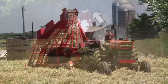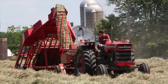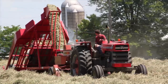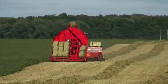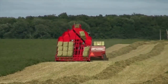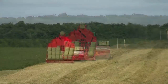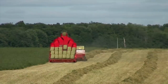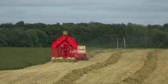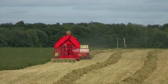On some models, the innovative twist design of the front chute places the bales on edge. Then gravity takes over. Guided by simple mechanical gates, the bales begin filling rows. The last bale in each row moves a gate which opens the next row. When all of the rows are filled, the last bale in the group automatically opens the accumulator's rear gate, allowing all the bales to slide out in one orderly grouping, ready for a Kuhn's grabber to pick them up.